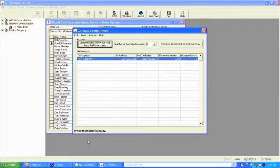When you look at the screen right here, it tells you the MAC address, using just the last two digits, is 2C77. And that would actually match on your gateway card. In here, you would have the installed location of where you installed it. Because you want to identify where you installed it, since you're never going to remember gateway 1 and a MAC address and where it's installed.